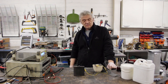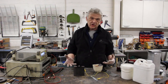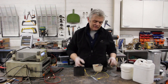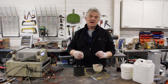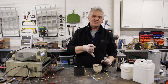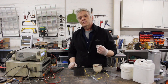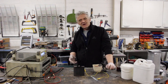The other question you might ask is what about recharging? It will recharge just like any other battery. Zinc has a really nasty habit of forming dendrites on recharge. The zinc is the negative, the carbon is the positive; your iodine will collect on your carbon and your zinc will collect on your zinc electrode, forming dendrites. That's why we put the terracotta pot in there — it stops the dendrites going through to the other side, which has been shown to work, so dendrite formation is no longer an issue on recharge.